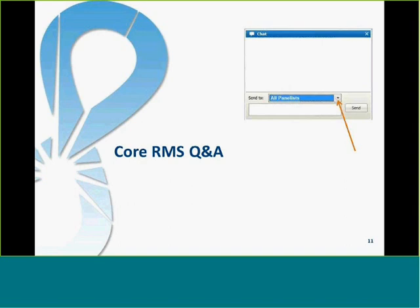Okay, that's great. Also, you detailed grounding. Can you go into the grounding details a little bit further? Sure, yeah. The grounding feature is one that we've worked hard on in the product group at SunLink. The clamp has a piercing feature that pierces through the anodization on the frame and effectively grounds the module to the system. And we've certified not only the clamp, but the entire system with ETL. So it's UL 2703 compliant as a grounding means, and it's certified for any module with a UL listing, which is a pretty nice feature.